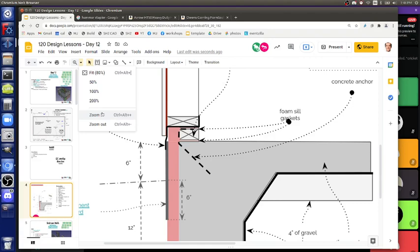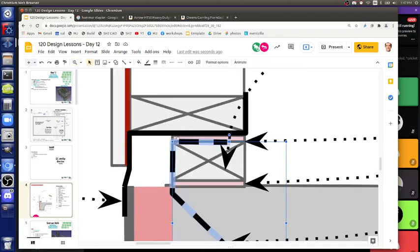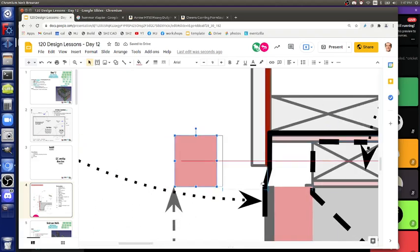Razor, or actually, more than that, a knife, because a razor does not go all the way through the insulation, so a knife would actually be better. We've got some knives in a tool chest there. But what would make sense too is, we've got the sill gasket, you see right there, it's a 2x4 sill gasket. I'd like to extend this sill gasket and make it the 2x6 version, so it's going to be laying on top of the insulation, like right here.